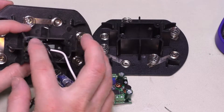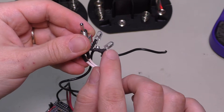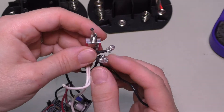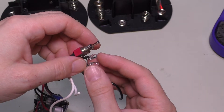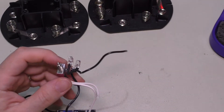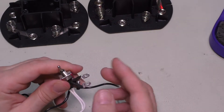So I'm going to completely disassemble the rest of this. Taking a close look at the LEDs — there's actually just a resistor wired into the positive side of each one, and the two negatives are connected directly to the negative rail and right to that switch. We're going to eliminate all that. The LEDs really didn't serve much purpose — I was trying to figure if I could use them as indicator lights to locate it at my campsite, but I really didn't use them. The only reason I did that at all was because I only had on-off-on switches, not standard off-on switches.